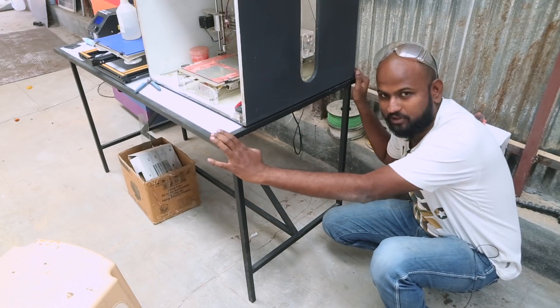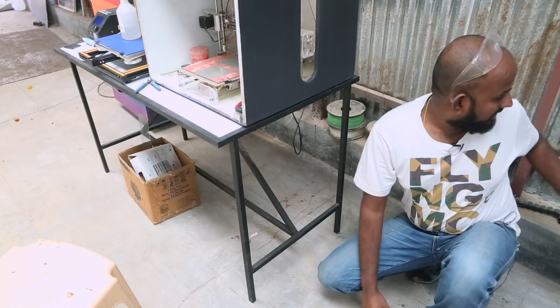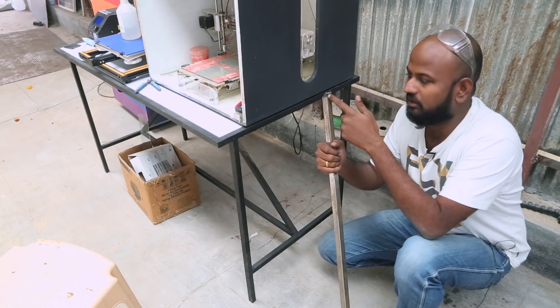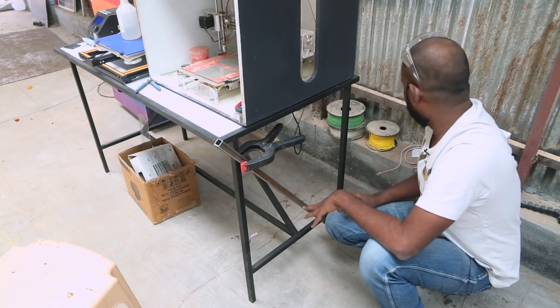So I'm going to take this as a reference, but go with my new design. The legs are going to cross, criss-cross like this. I have already cut a piece like this with a small angle, around 40 degrees, so that I can place it here and then clamp it. That sets the angle of this one.